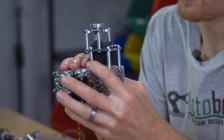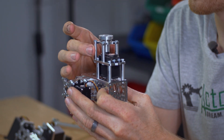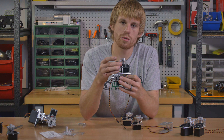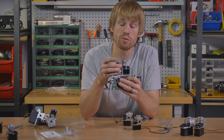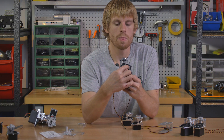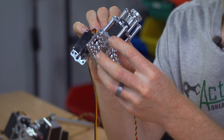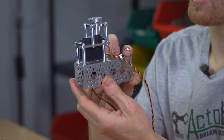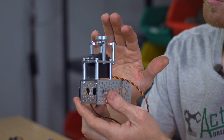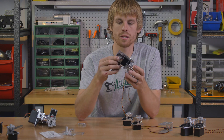If you wanted to mount it straight on the top of a piece of channel, what I like doing is actually replacing the sides — take out the quad hub mounts and then run one inch standoffs on it in place of those sides. That allows you to run socket head screws down here through the servo mount to attach to your channel. You could drop this assembly down in the inside of the piece of channel if you want to keep it nice and sleek and low profile.